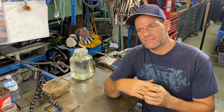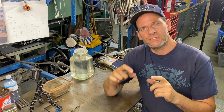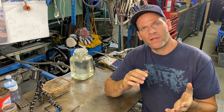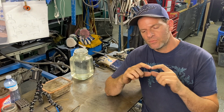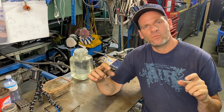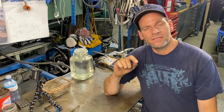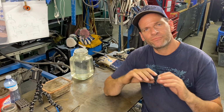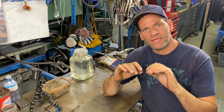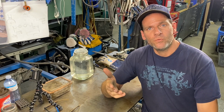So I think I'm going to make a triangular cutout into the actual Damascus. I'm going to program a triangle toolpath in my CAD software and multiply that along the whole billet. Then I'm going to put it on my CNC machine and cut that shape out, about 200 thou, or just shy of a 1/4 inch, into the material. So once I forge it down, we're still going to see that shape in theory on the billet. Now before we can do that, we've got to make a billet.